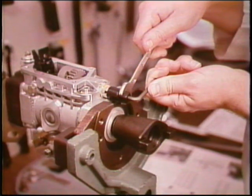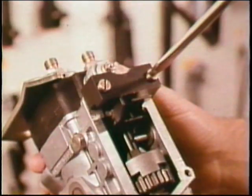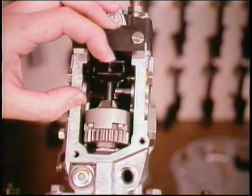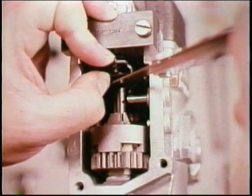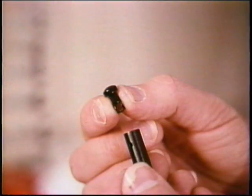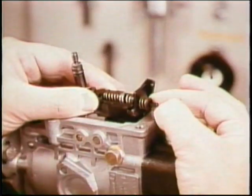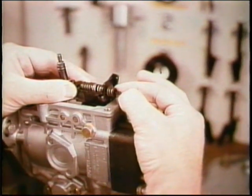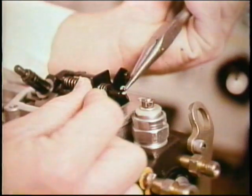Now, with the pump horizontal, lock the governor's shaft into position using this pin wrench. This is the spacer block used to measure the starting fuel dimension. To make this check, push the governor lever against its stop pin. As you compress the starting lever, measure the gap between the guide bushing plug and the starting lever. If necessary, correct the dimension by changing the guide bushing end plug. Remove the spacer block. Slide the governor's spring assembly shaft into the governor lever. Install the idling spring, then fasten with the C-clip.